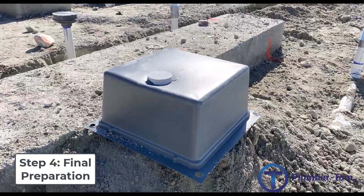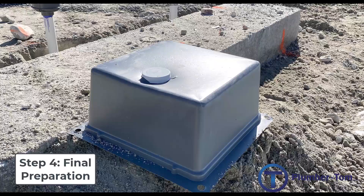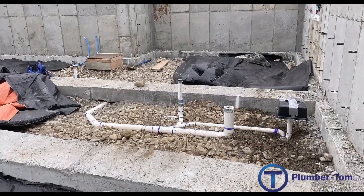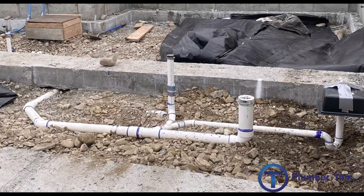Having a tub box like this can keep the concrete away from the pipe and enable us later to hook up that tub with less inconvenience. It's not going to ever be easy, but this will help a lot. Ultimately, the entire drainage system below the floor in the ground will have to be tested and inspected before it is buried and covered under a concrete floor.